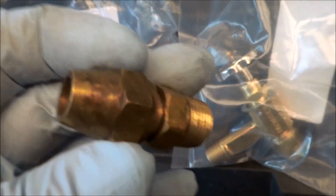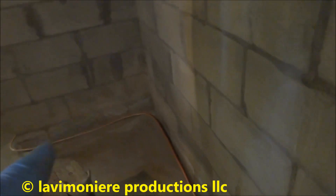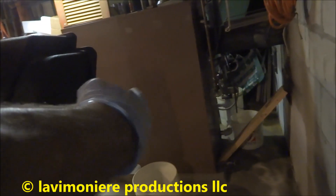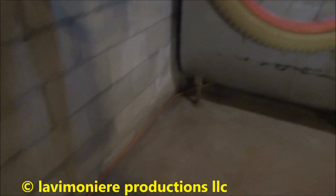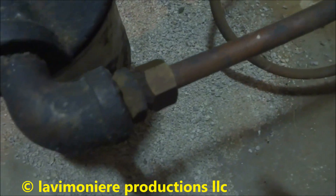Right now they've got compression fittings. I'm gonna run it along the back of the tank, along this wall, along this wall, and then along this wall, around into the boiler, around the back, and I'll clip it with clips and concrete anchors. You can see the compression nut — I can't use that, it's got to be flare.